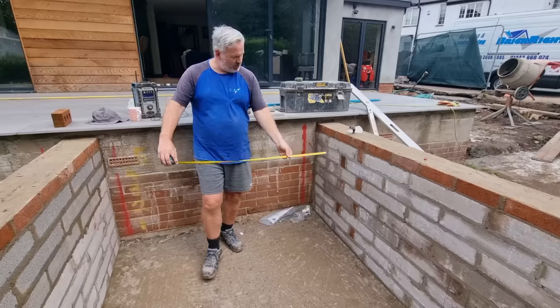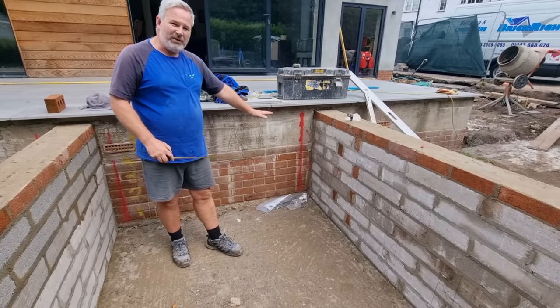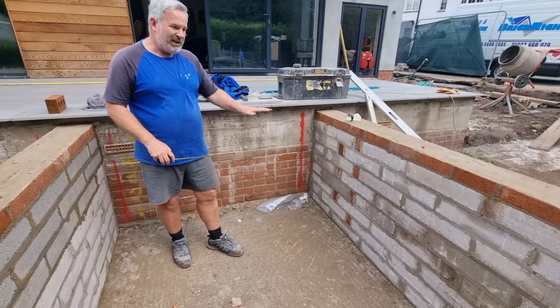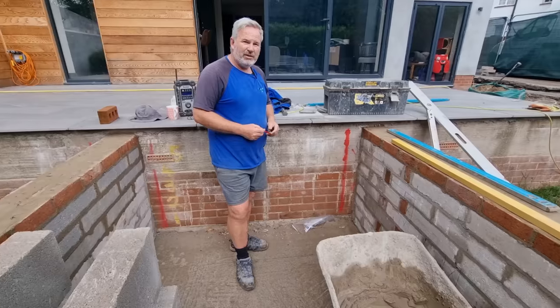That's one step, two, down to five. And then we'll fill the steps up with like scalpins or stone. And then the tops will be filled with concrete. We can slab straight over the top of that. So watch us do it.